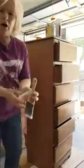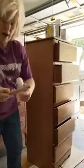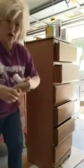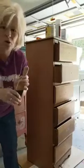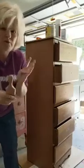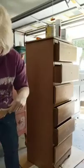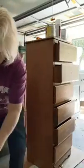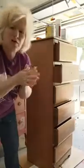If you're doing a tabletop, same thing. You're going to do one section at a time, right? You're going to roll, and then you're going to get your expensive brush, and you're going to feather across to smooth everything out. So that's what you're going to do. You do at least 2 coats. If you are working with pure white, I do a minimum of 4 coats when I'm working with pure white paint. 4 coats. It just requires a lot more coats. That's just the way it is. So there you go. That is the rundown of how to paint. Hopefully this will help her.